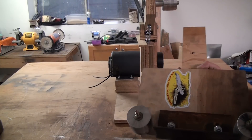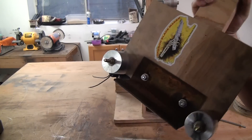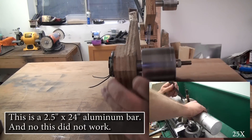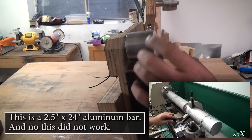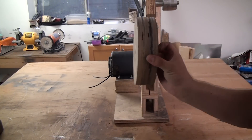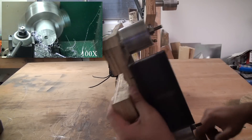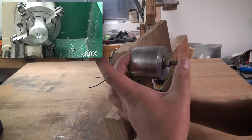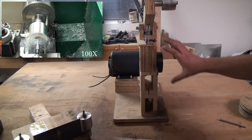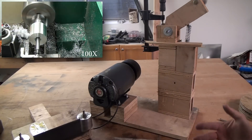I made it adjustable but ended up not needing to adjust it. It's literally all plywood — just glued and screwed together. I made all these wheels on the lathe as well. They're two inches long for a two-inch belt; I kind of wish I'd made them two and a half inches. I also crowned each of them — either two or three degrees — and I crowned this one too. I understand the wheels on your platen generally shouldn't be crowned, so I probably would not put a crown on those, especially since they're not really in charge of tracking.